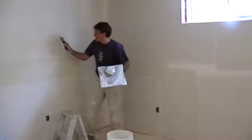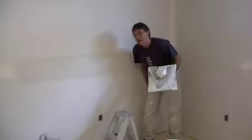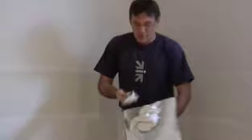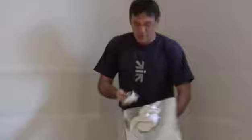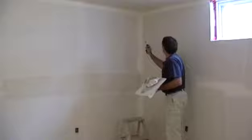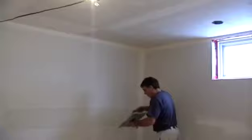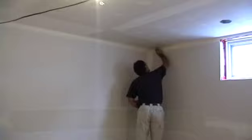While I unload the six-inch knife - it is a matter of flex. Flex and when you lay it down, that leaves the mud in the middle and tapers off the two sides - that's what we're looking for. My inside corners are done with a four-inch knife. The techniques with a four-inch knife are the same - we're making that little triangle deal. What we want up here is a matter of one joint away from the other. The ceiling tapered joints are going across this way, so those factory tapered joints are going that way. That's the corner I want to do first. This should be set for me but we're going to do it anyways because I know how to fix it later, which I'll be showing you on the finished coat.